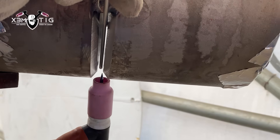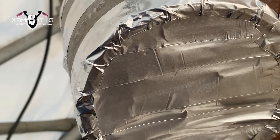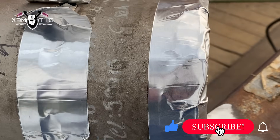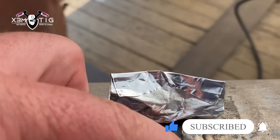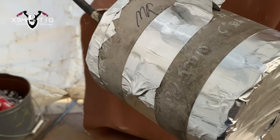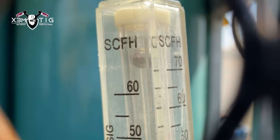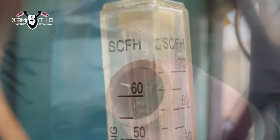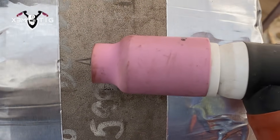You've got to be careful with your inclination, especially the way you're opening that gap because you're purging. This is a little different from stainless. Even with purging, the argon flow settings and your amperage are different. The way I'm purging this Inconel is pretty much closed — the only vent is up on top. On my flow meter, I've got it at more than 70, and I'd recommend maxing it out all the way. Tungsten is 1/8" and cup size is eight.